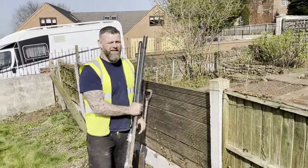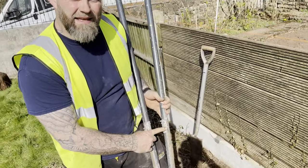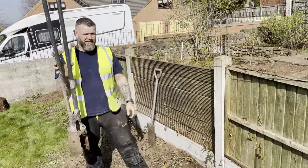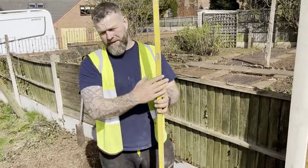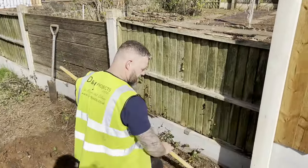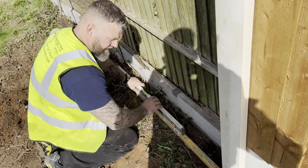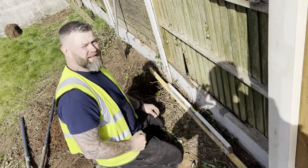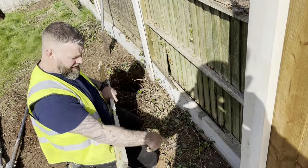Hole's finished. You're going to ask: how do I know the hole is the right depth? Instead of getting your tape out every single time, we put bits of insulation tape on these at two foot — so when that gets level with the ground, you know exactly it's two foot in the ground. Top tip. Next stage: bring your level or piece of wood, and let's start leveling this ground up ready for the gravel board. Dig it out and keep checking — that will save you a lot of backache. Lift the gravel board in, level it off, and then we'll get to the next stage.